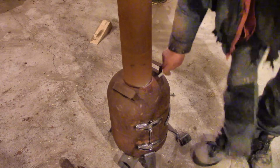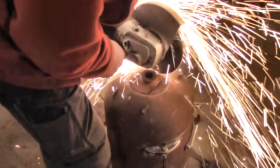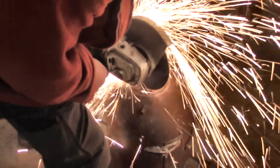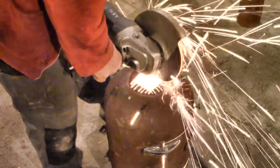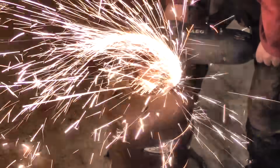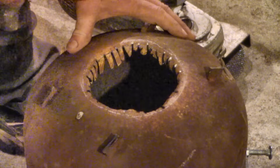A conventional steam boiler has a tank of water that you heat up till it's boiling. The water wants to turn to steam but there's only room for some to do that, so the pressure builds up inside. When you open a small valve, the steam rushes out and you can use that to drive an engine. It's a pretty good system because not much of the heat energy is wasted — it's stored in the boiler as very hot water and it's ready to use whenever you are.